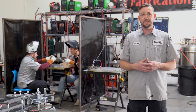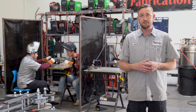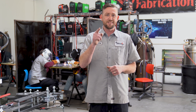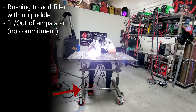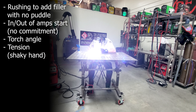You could also take a look at your surroundings. Notice in the picture on the right there is an ominous glow on the wall on the weld that I screwed up, but it's not there on the control weld. This would indicate that I definitely had way too much torch height and the arc was blowing out. Running with a high torch height is not considered good discipline in welding. If I scrub back and look at some of my footage and zoom in on my foot, you'll notice it doesn't move — meaning I had absolutely zero control over this weld. I just kept it flat out and ran it.